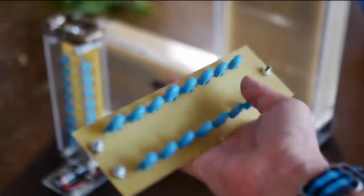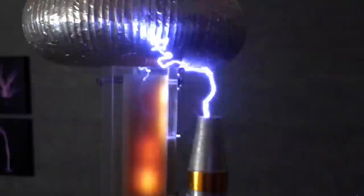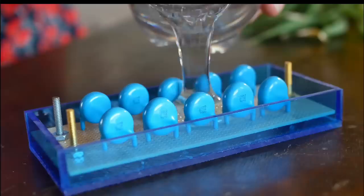Over the years I've built numerous high voltage multipliers of virtually every shape and size — they're just about my favorite high voltage device, not just because they can provide multiple voltages at once, but also for the sheer level of voltage they can produce. It's just insane. The real struggle was going to be just how small I could build this voltage multiplier while still maintaining a decent — hopefully high — power output. Plus, all the components will be charged to a really high voltage, and high voltage likes to ionize gas. That means if these devices are operated in open air, they lose lots of energy to coronal discharge. So the entire circuit will need to be potted in clear resin, like I've done in a past project.